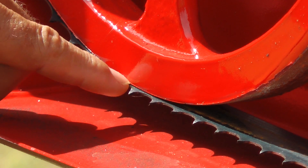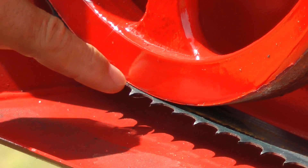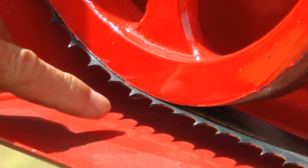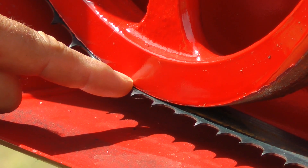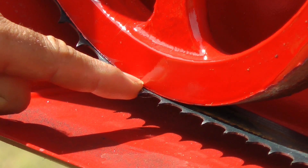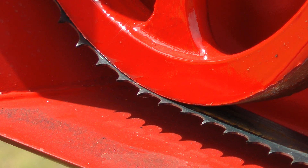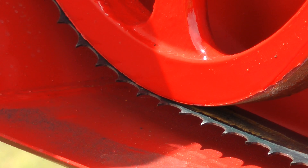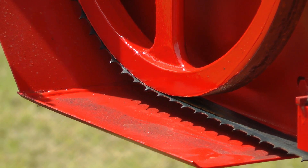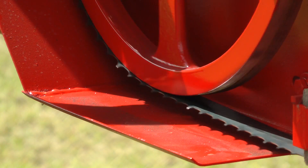We'll go around the other side and I'll show you how the tensioning should look. If you see right here, we want the gullet of the blade to be pretty close to even with the side of the wheel right here. So we're out at maybe a sixteenth — that's fine. Even an eighth would probably be okay, but you want to be close. If you get a blade and put it on, I'm going to back off another round or two and spin it in the direction of the cut, like this.